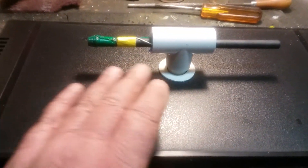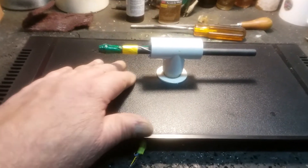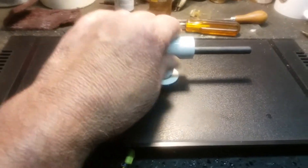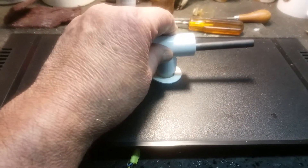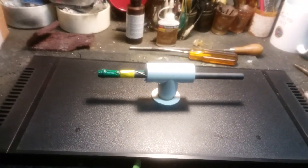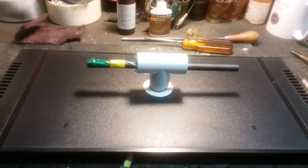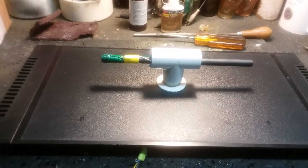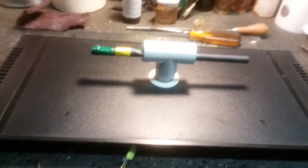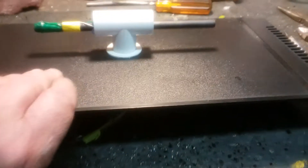The plate would go all the way around with a compass rose printed on it, so you can turn this thing. If this is in your cabinet at home, you'd turn the rose to north and leave it there — that way you have a reference. I may or may not do that. The way I've been using this is I just tune it for the greatest signal, and for doing nulls it's 90 degrees off.